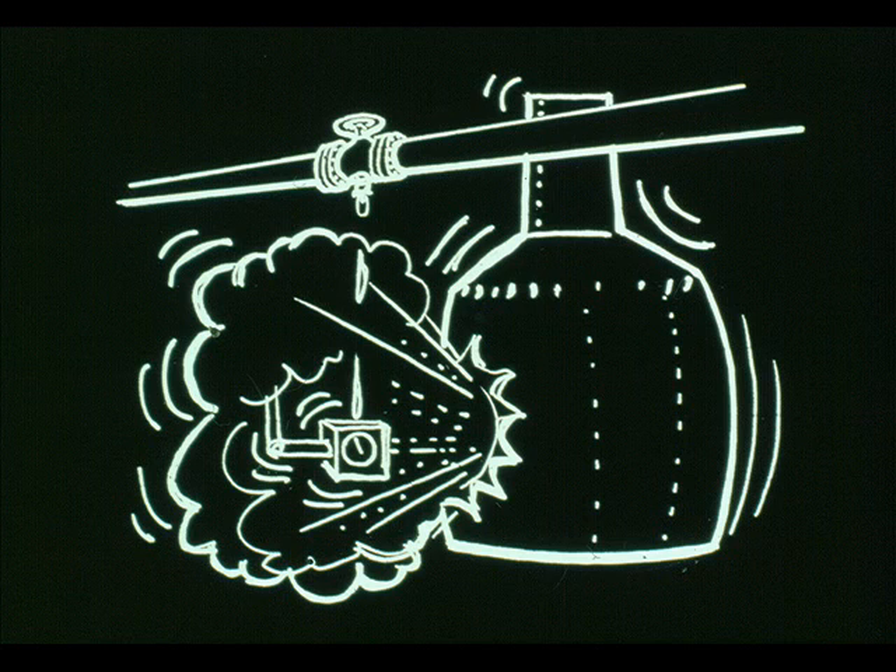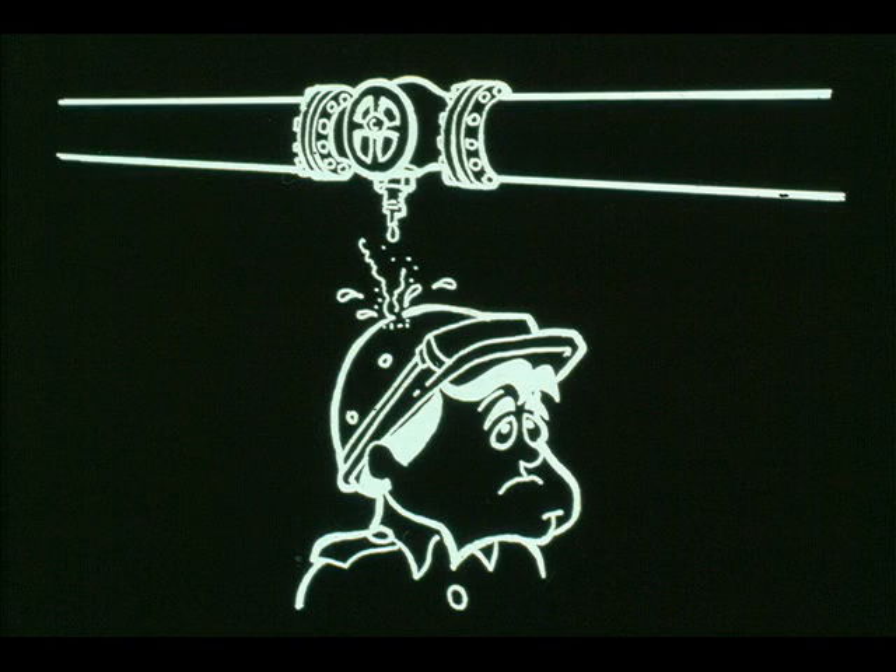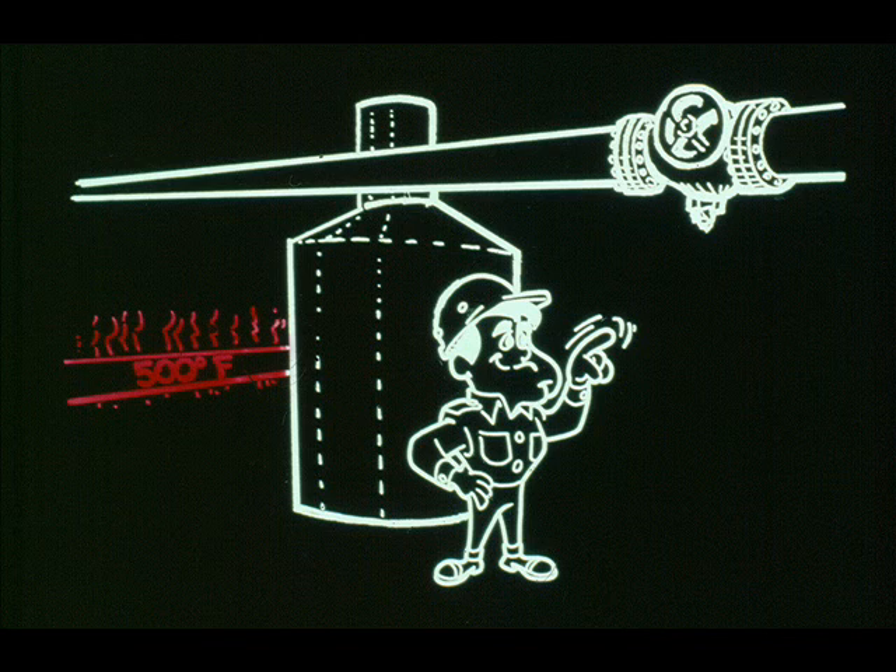An example would be a fuel gas regulator on a furnace. Elevated valves with drains are a hazard to anyone who might be in the immediate area. The release of a hazardous material, such as acid, is very dangerous. A strong wind can blow the acid to other locations. Piping the drain material to a safe location can remove the accident potential from these examples.